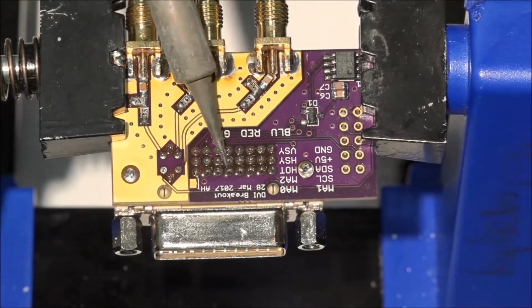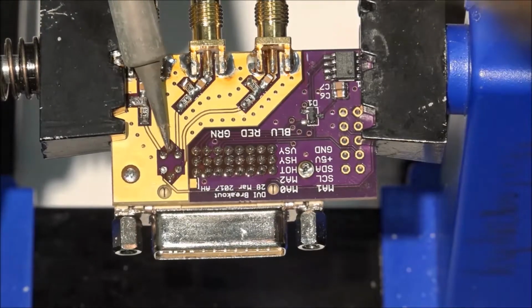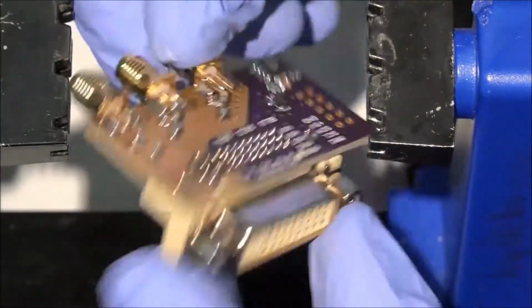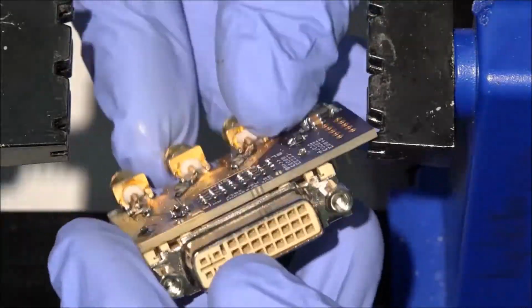After soldering all of them, go back and reflow them just to verify they have the right amount of solder and were soldered correctly. Fix any imperfections you find, and remember to keep your soldering iron tip clean.